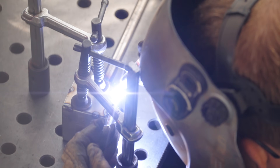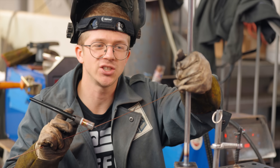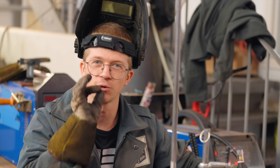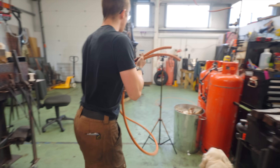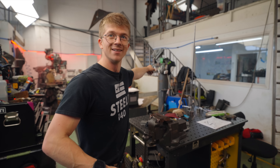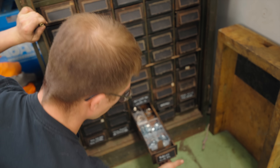I had to stick the tungsten on the first attempt. Is that where the term dipstick comes from? I think that's dipshit. I have to stick the tungsten on the other side. Fortunately, not only do we have purge holes where I drilled them, we also have them all around the edges of this awfully TIG welded box. So we're going to really make sure that there's no oxygen getting in here — we purge the argon through every square millimeter. I found a better hose, which is going to be ten times better and means I can leave the argon bottle exactly where it is, in situ at the welder.